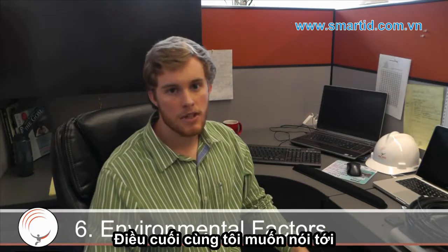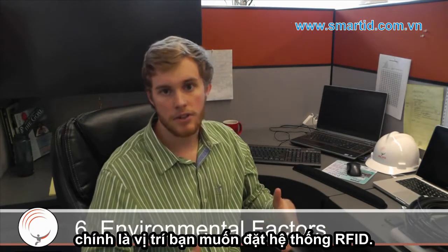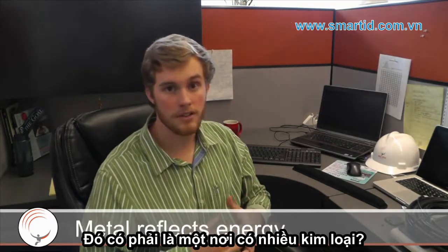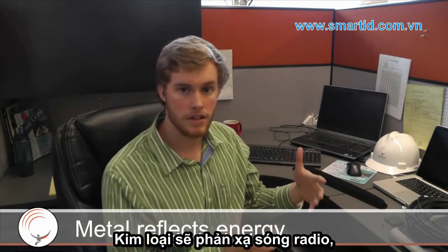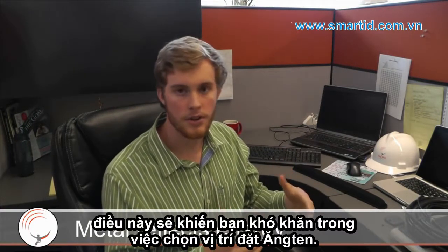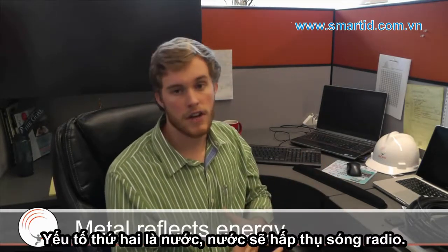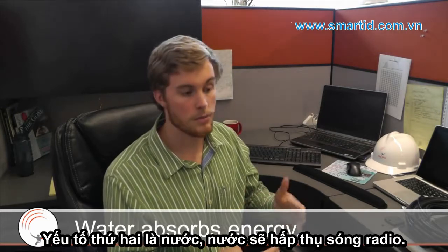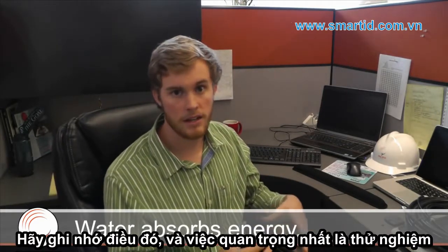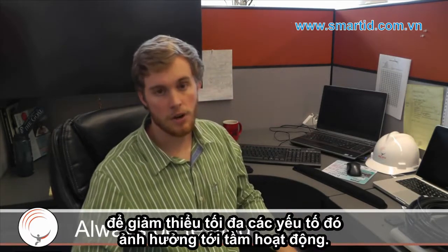All right, the last thing I wanted to tip you off on read range is your environmental setting. Where are you putting the system? Is it a place where there's a lot of metal? Metal is going to reflect UHF RFID energy, and that's going to make it unpredictable as far as where can I place my antenna to get the best read range. The other factor is water, which will absorb RF energy. So keep those two factors in mind, and always remember that testing is the best way to decrease the possibility that you're going to have problems with those two things.